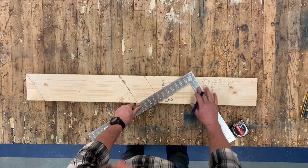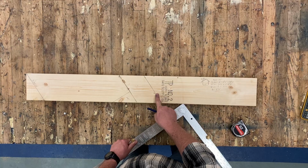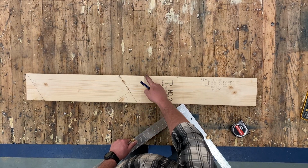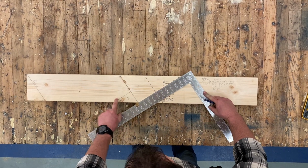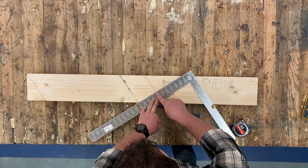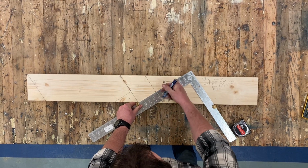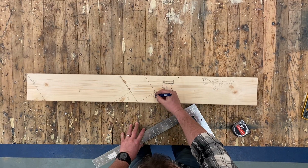This is the square cut, all right? So this is a plumb cut for a rafter tail. This would be the square cut for the rafter tail, which we call a combination cut. I just slide this down just like I did this bird's mouth, all right? I'm gonna put 8 in line with this line, my back side of my tail cut, and mark another bird's mouth. So basically I've got 2 bird's mouths.